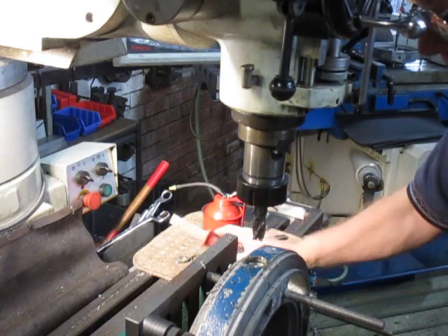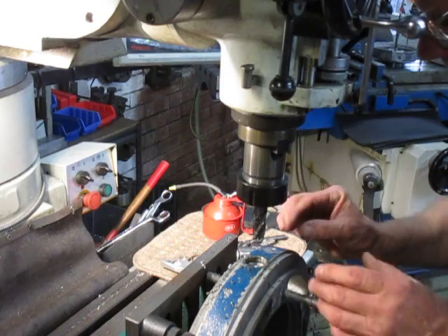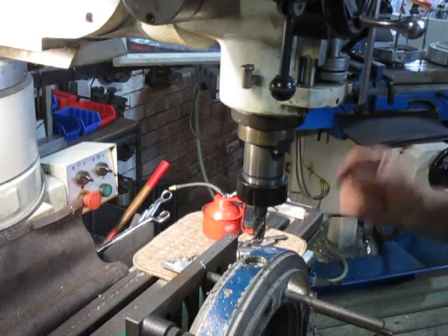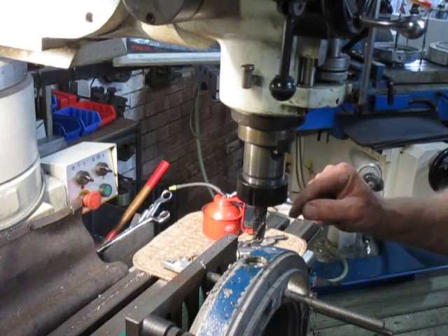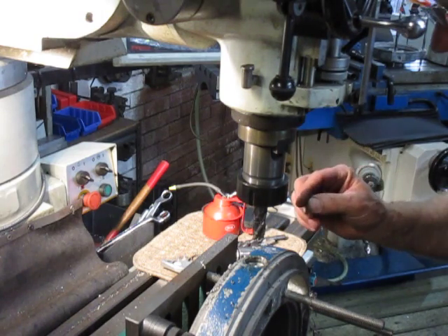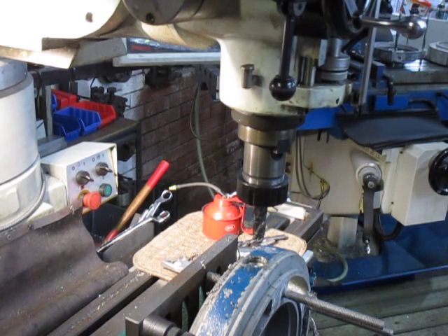So now we can proceed — I can see the actual bolt itself. We'll proceed from here to drill it out a bit more, ream it out with another mill, a little smaller mill, get that nicely centred up again and get her out. We're up on time here so we'll have to stop.